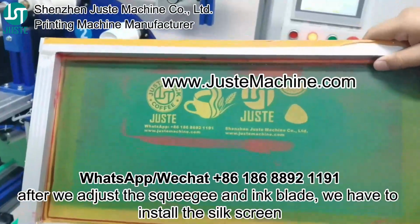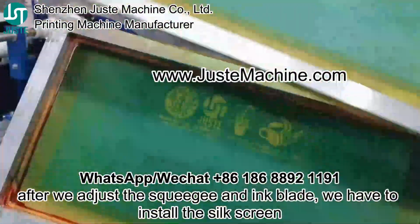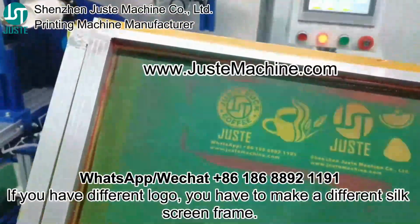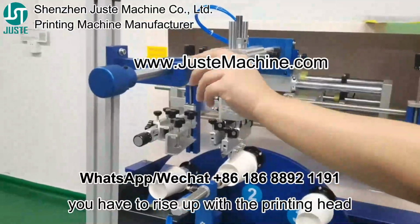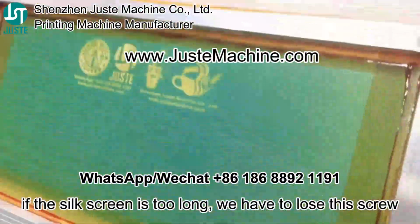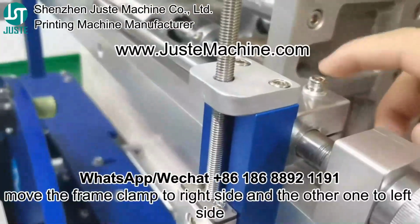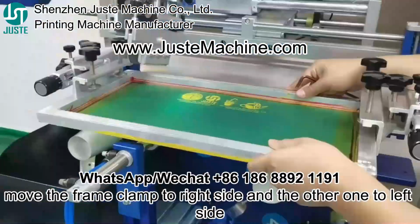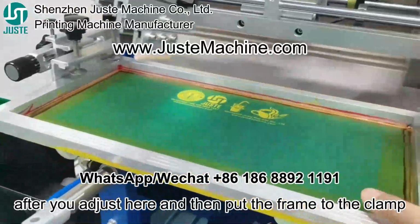After we adjust the squeegee and the ink blade, we have to install the silk screen. If you have a different logo, you have to make a different silk screen. Okay. Before you install the silk screen, you have to raise up the printing head. If the silk screen is too long, we have to loosen this screw, move the frame clamp to right side and the other one to left side. After you adjust here, then put the frame to the clamp.